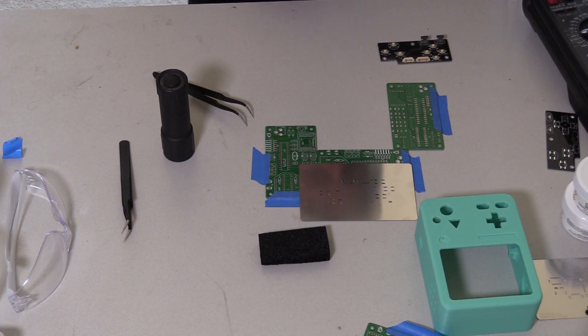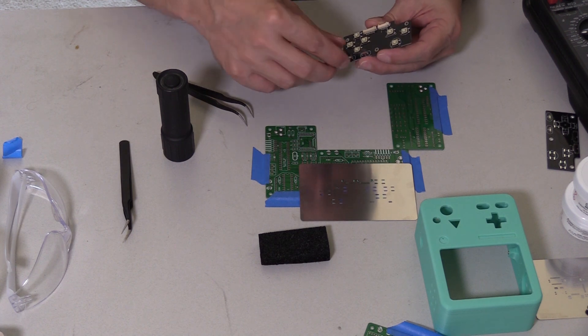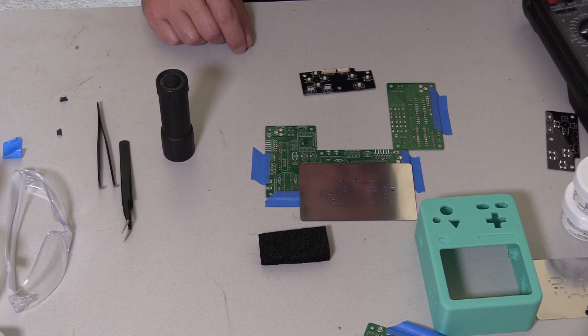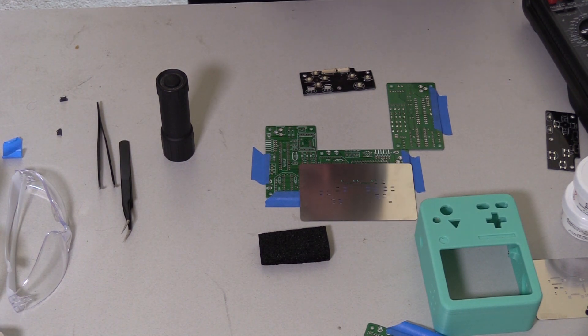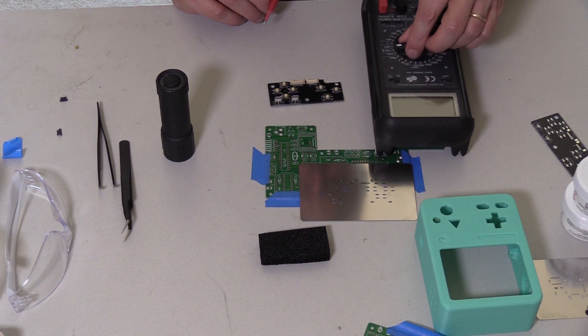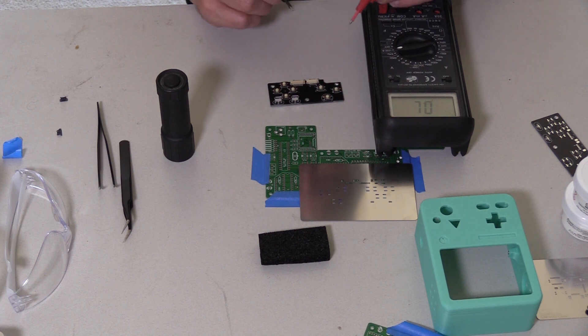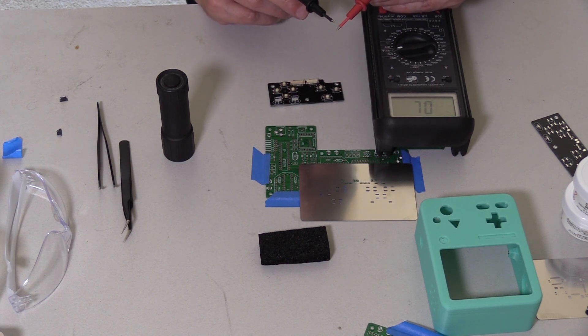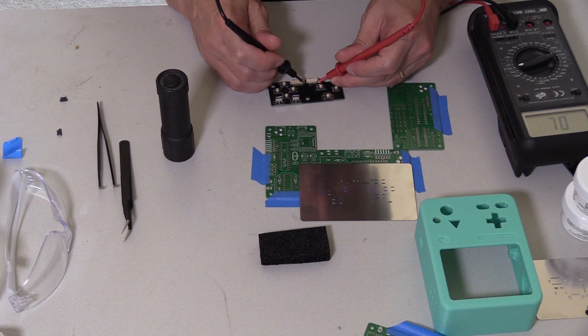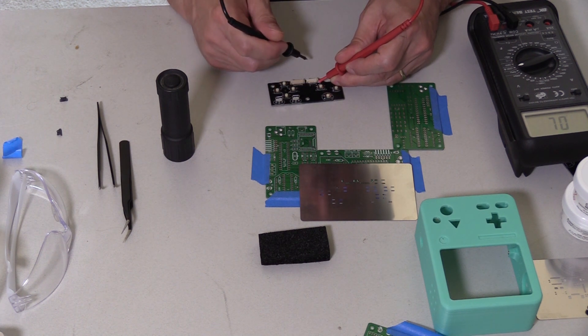Welcome back — here is our board. It's cooled off and ready to go. This is a pretty simple board; the only thing I'm really concerned about is whether there are any shorts on the USB port connector right there. I'm just going to check those pins to see if they're shorted. I use this continuity tester — if it detects continuity, it gives you a sound. All I'm going to do is touch it to one of the pins and then check the rest of them, and there's no sound.